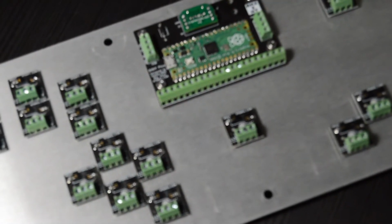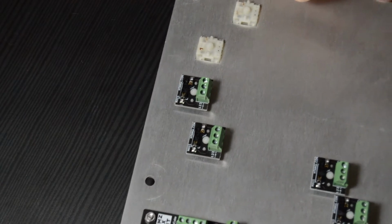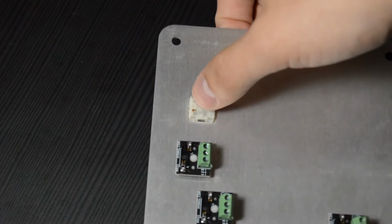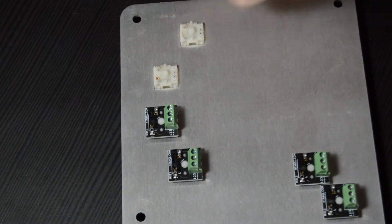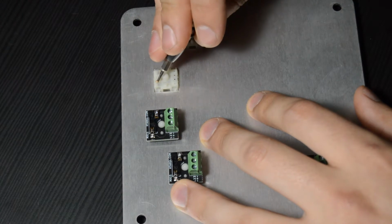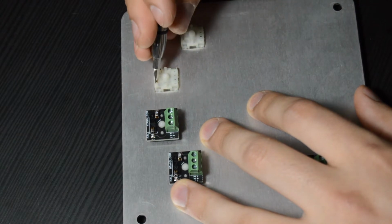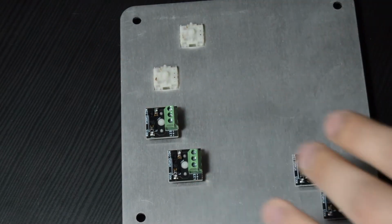It's actually very easy to do, and like I stated earlier, if you do not have those pins straight when you're slotting these on, it is very easy to bend a pin, and you'll see there that it's squished down. But luckily, these are very easy to fix, and I'm going to show you how to do that here. I'm going to take my flathead screwdriver and pull it back into place to where it's poking up, but we still need it to be straightened out.